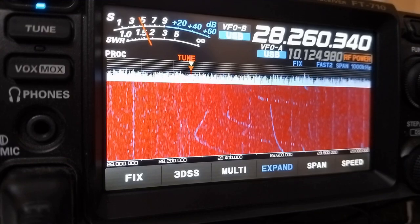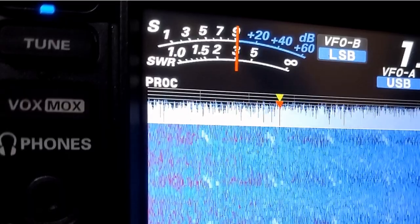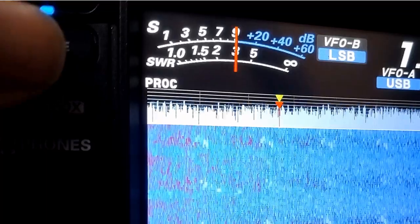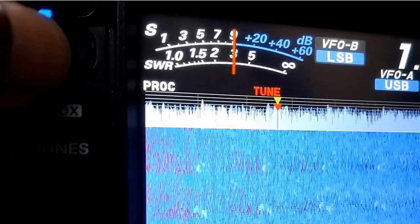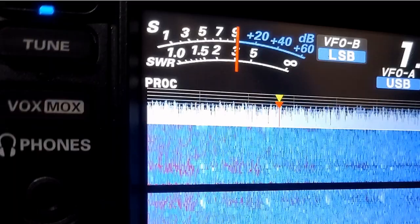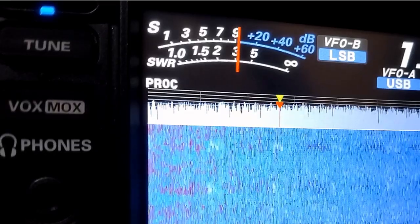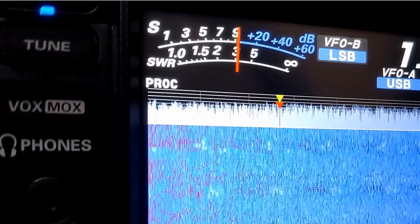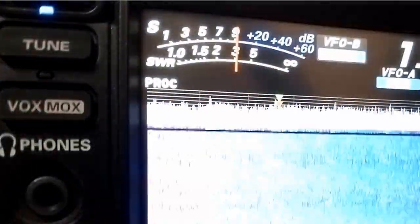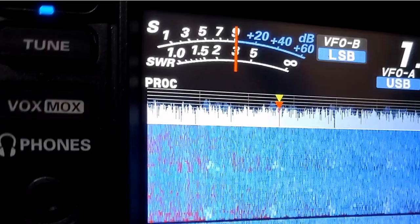Within another 10 kHz or so, if you operate on the same frequency, you do not have to tune again. If you try to tune to a band which is not within the range of the antenna — as demonstrated here with the 160 meter band, which is nowhere near the range of that antenna — the radio refuses to tune. It shows a high SWR indicator and refuses to tune.